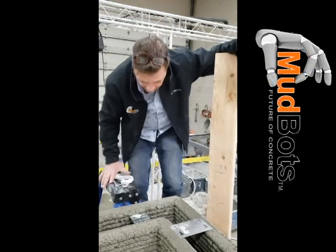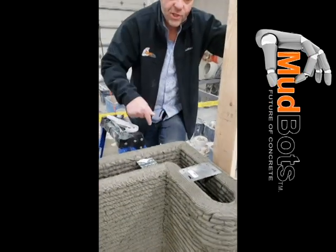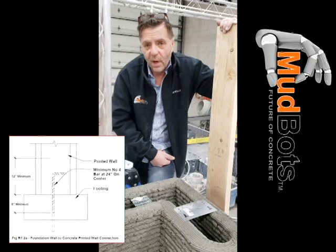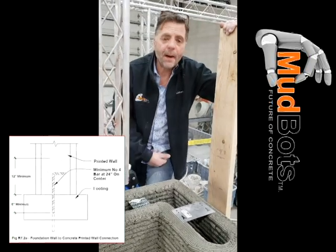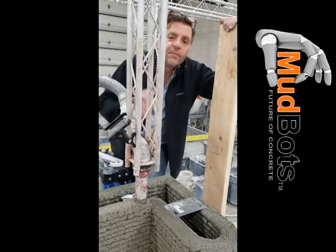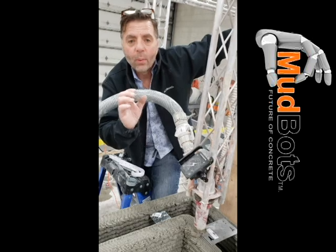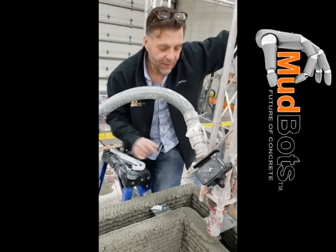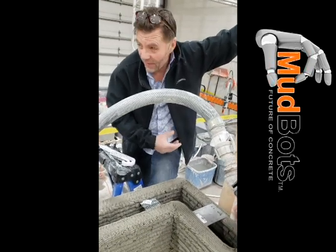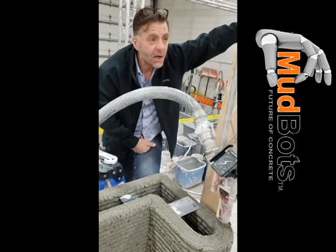Let's talk about a couple of different solutions. Tying this wall into the foundation is simple — you use a J-bar or S-bar. We print the bottom 12 inches solid, which ties it into the bar coming up out of the footing. Our printer prints the footing forms and does the backfilling for the footing. We also print the forms for the slab — there is no more labor for creating forms for footings or slabs.